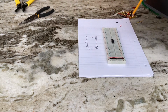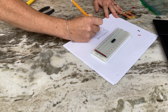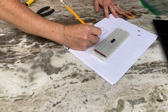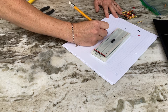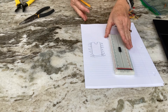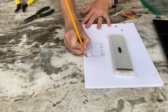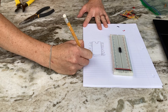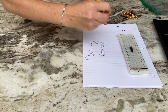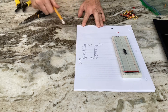Let's draw the pinout: pins one through fourteen. The pinout is your map for wiring the AND gate. It tells you that pin seven is supposed to be mounted to ground and pin fourteen is supposed to be wired to VCC.